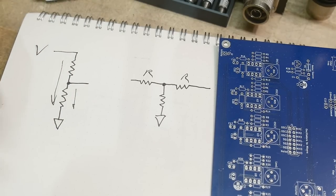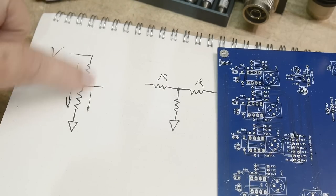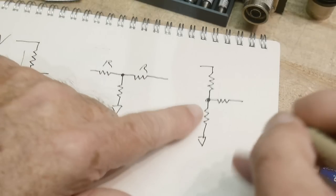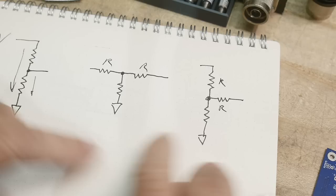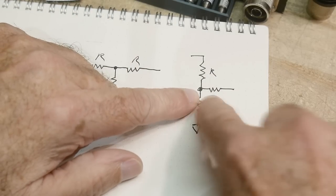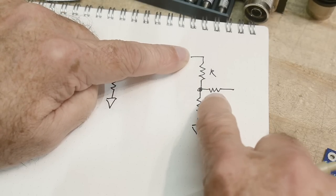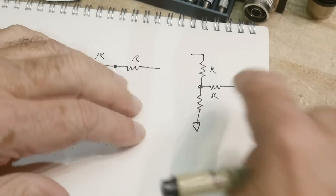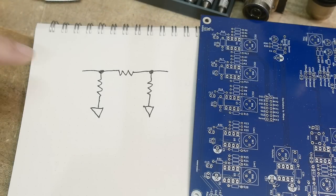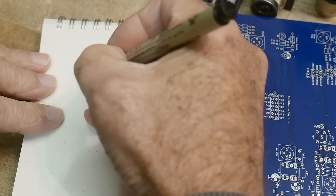Before we get to the Pi, let me give some insight into how the T-network works. If I redraw it, you can see these are the R's — and it's just a resistive divider, and then we change the output impedance by adding this extra resistor. But if you put a voltage here, having that resistor here or not having it here would not change the voltage on the output, depending on loading. So redrawing things can really clarify what's going on.